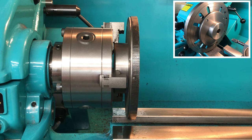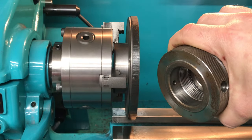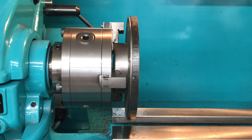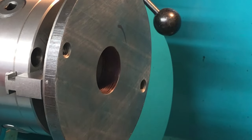The counterbore is machined to size and I've modeled that based on this ER40 collet chuck which I've shown in a previous video, so it will match dimensionally the interface on the inside of this chuck. I haven't been able to trial fit it onto the machine yet because the threads aren't formed. I've blacked up that bore now ready to machine the threads into it. I've got a new boring bar with a 60 degree threading insert, and I'm going to set that up for centre height now.